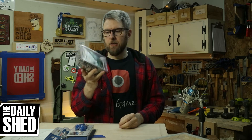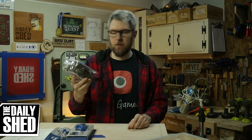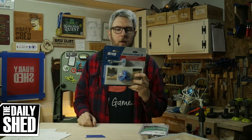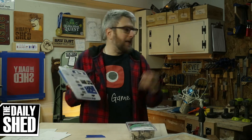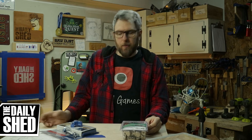Some people call them cup hinges. These are very inexpensive — there are five packs of hinges in here and I think I paid less than $20. These are usually like $15 to $20 per set of two hinges, so these are super cheap — not recommended for professional use, but that's fine for a leveling up scale. I also purchased the Kreg concealed hinge jig. This jig comes with a bit sized to fit these hinges; you pop it on and drill, you're done. Super easy. I figured if I'm going to be doing these in the future — which I probably will — I'd want the jig. I thought I would level up and try something new.